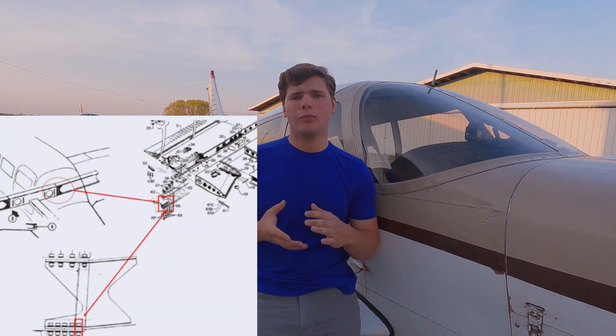The wing spar cracks in the bolt holes — I believe the inboard ones, closest to the spar carry-through box. There's not a lot of surface area there, but the spar actually cracks in the bolt holes. What you do is pull some panels on the bottom of the wing and possibly access it through the center of the aircraft as well. You pull out two bolts from each side and run an eddy current test. SoCal Flying Monkey has a great video on that — I'll link it below — where he does his eddy current test and explains what it does.